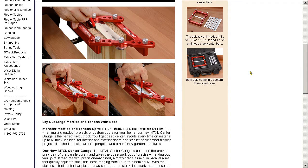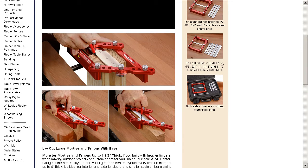Unfortunately, that's since been handed on as a present to another woodworker, so I've now got to make another replica of this thing. And having done it before, I can see that there are one or two issues with their design. The first thing I found was these thumb screws didn't really pull it in tight enough, so on the last one I actually added some springs to give it some extra clamp.